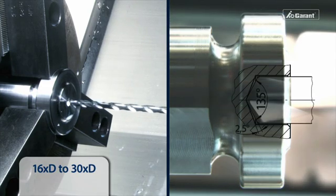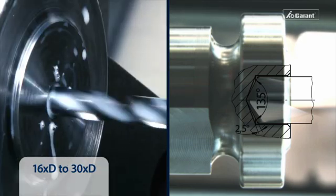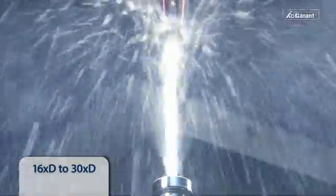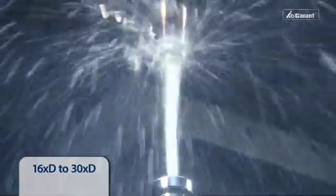When drilling horizontally, the drill should be inserted with vertically positioned cutting edges, without internal cooling, up to 0.5 times D from the pilot hole bottom. If no drilling cycle is being used, chip clearance is not required.